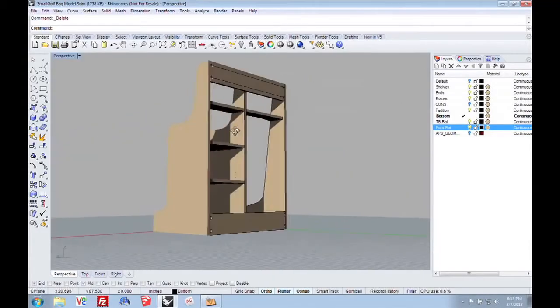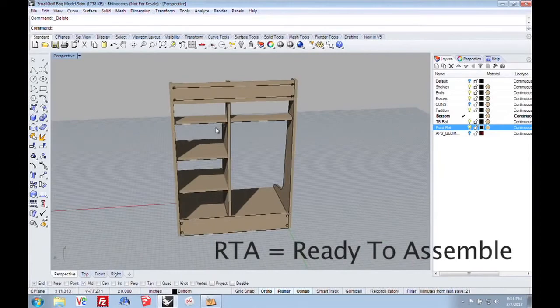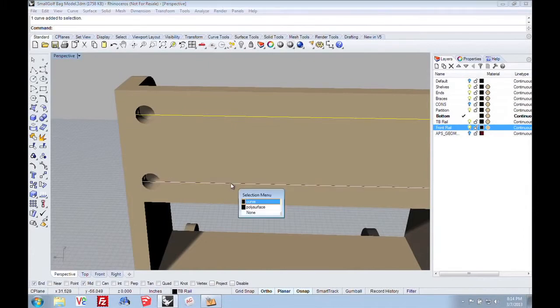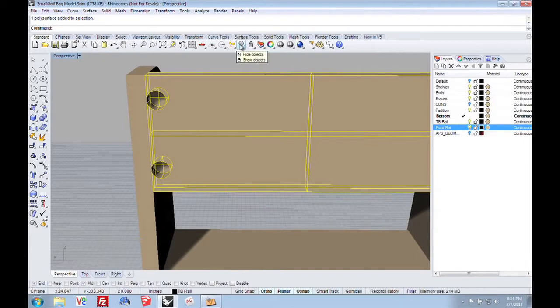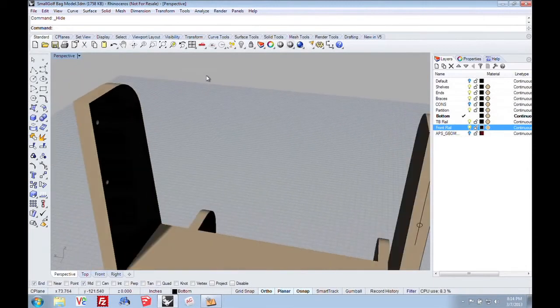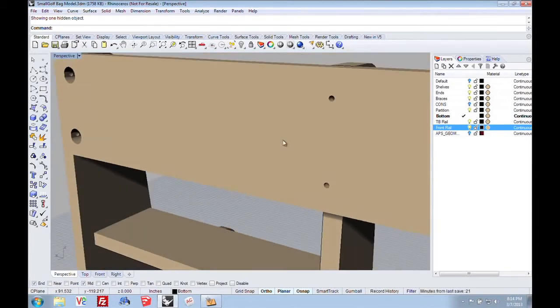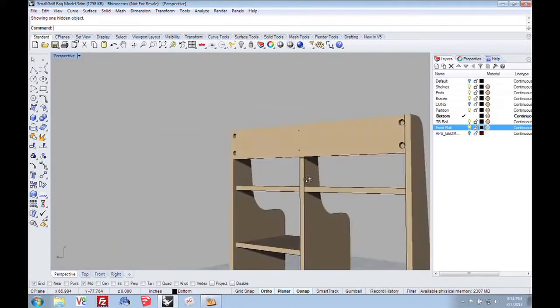Here's the golf bag rack — it's just several pieces. It comes out of one sheet of material and it's RTA. Let's zoom in on the back where you can see some guidelines I used to help line things up. These are the actual pockets that the Rayfix fasteners go in. If I take that part and delete it, you see there's the holes. The nice part about this is because it's all drawn together, everything lines up — that's really a real advantage. These other holes are through holes that are going to have screws, because that didn't make sense to put Rayfixes in there. That's how I designed the product.